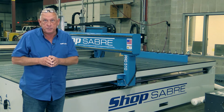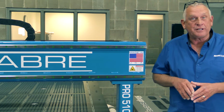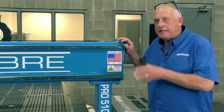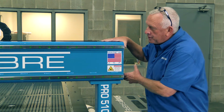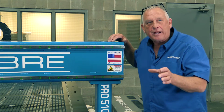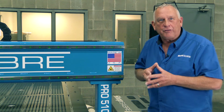Now, let's look at motion control. The first part of machine motion is actually defining the axis of motion, and let's look at that. What you see here are precision contour guide rails, and that's actually what causes these axes to move. But there's more to it than that. They're actually mounted to a machine gantry, and the surfaces they mount to are machined, and that's what actually contributes so much to the accuracy. Since we're an American manufacturer, we have total control of all that.